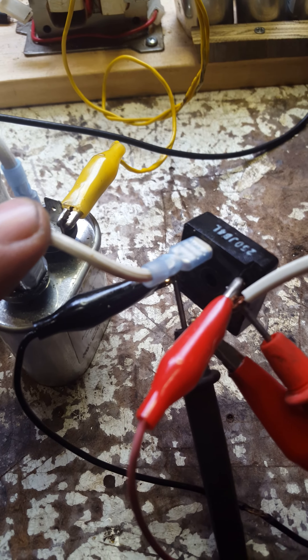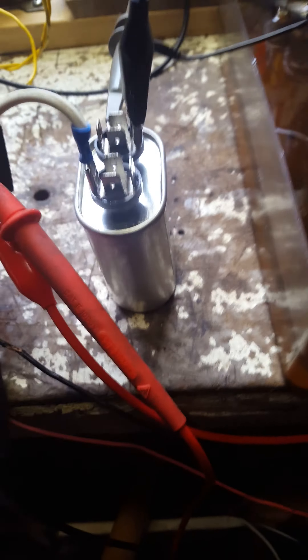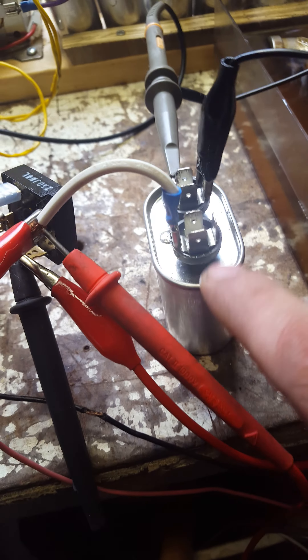Into a bridge rectifier — standard 120 volt. The output here is approximately 120 volts AC, and through the rectifier it ends up dropping to around 109 volts or so coming out. But once we put the load on there it changes as well — it drops down.